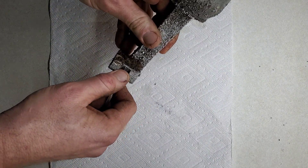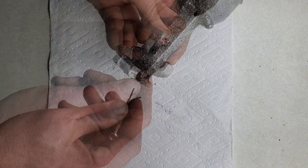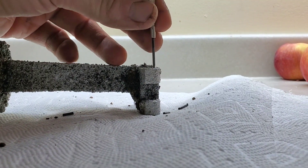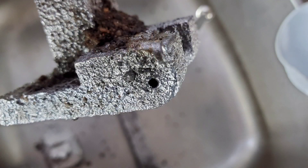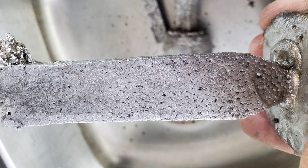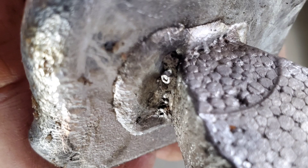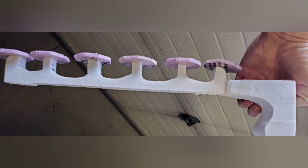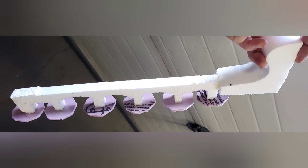I think this worked out quite well because aluminum pours a lot cooler than some of the other metals, but I don't think this would work for bronze, which was originally my intent. It did, however, make a perfectly sized hole just like I had hoped, except the screwdriver got stuck on one side because I was a little overzealous. As for the plaster covered side, it looks quite good — you can actually see the polystyrene and the fine detail on the hole. Next up, let's try doing it a little bit differently with better gating, a lot more safety, and see how that goes.